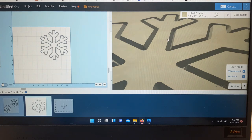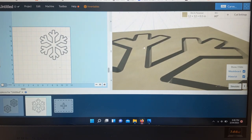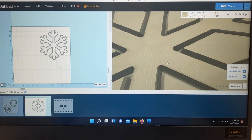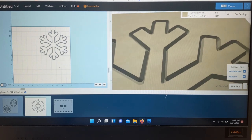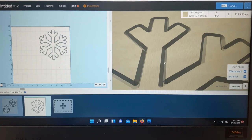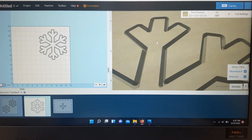This is going to leave just a slight bevel — I've set my depth to about an eighth of an inch. All it does is run through and cut down an eighth of an inch with that bevel. Then when you go back through and run your cutout or perimeter pass, it comes right down in the valley because the center of your 60-degree V-bit is the same as the center of your end mill. It cuts down and does a standard perimeter cut, leaving you with just that little bevel on top of your project.